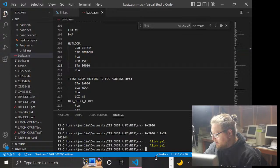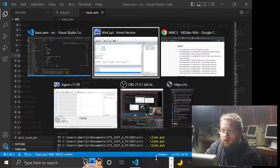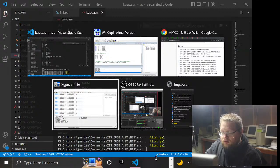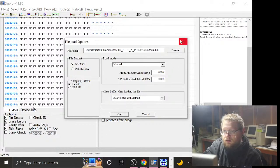And then tomorrow we can work on hooking up some address lines to the GAL. As many of the high order, but not two high order address pins as we can, to segregate some of the SRAM address space without losing too much actual SRAM. But for now, we have built the thing, and we shall program the thing. Let's load the thing to the thing.